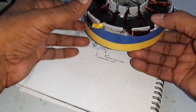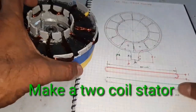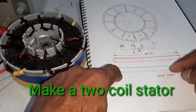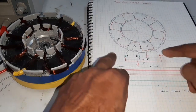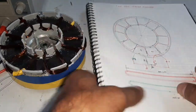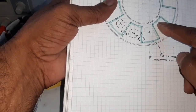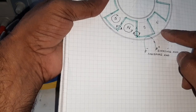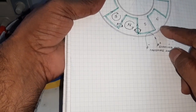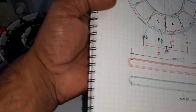Now I am going to wind a double coil stator winding. Here I am taking two coils — red color and green color — each coil has 16 turns. In a single coil, one pole has one open face — three sides are closed and one face is open — so the starting torque is very poor in the single coil. In order to improve the starting torque, here I am using two coils.